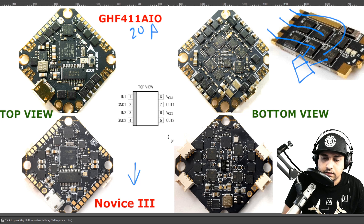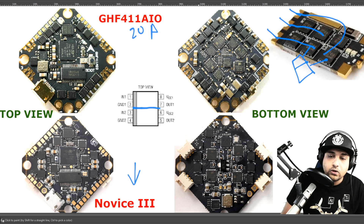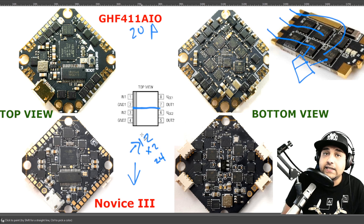The Novice is rocking the dual-channel FET, which means it's using one FET that has both FETs inside for each phase. If we start counting, we'll find 12 here — 12 FETs that are dual-channel, so times two would be 24, but it is physically 12 FETs.